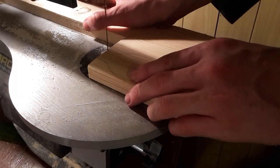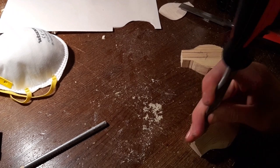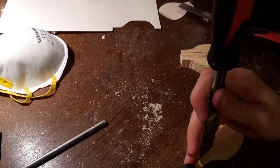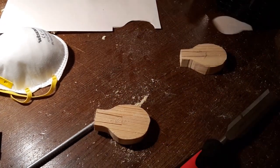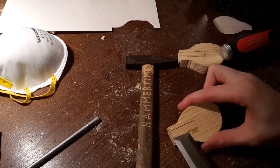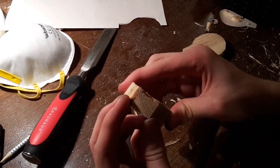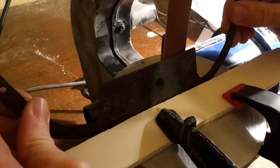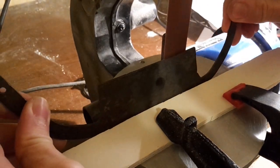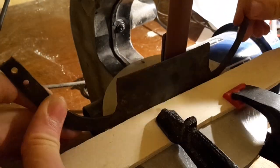Now sort the pieces for the handle. I am using 18mm pine. I put a template for the grips in the description. Carve out the area where the shoulders of the draw knife will sit. The slots don't have to look perfect — they won't be visible later. Now sharpen the blade; it's easier to do this before the handles are attached. Clamping a block to the tool rest makes it easy to get a consistent angle and an even bevel.